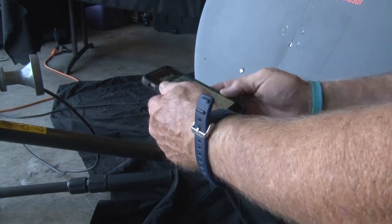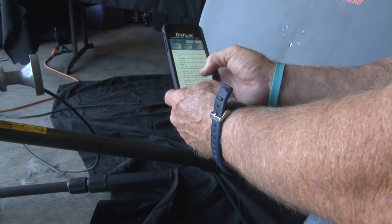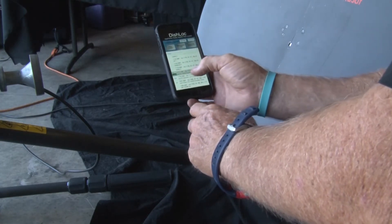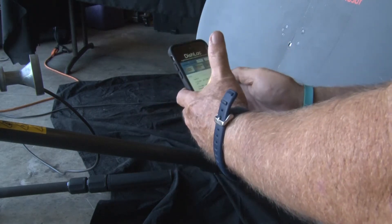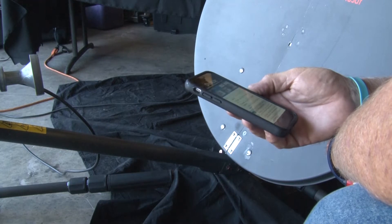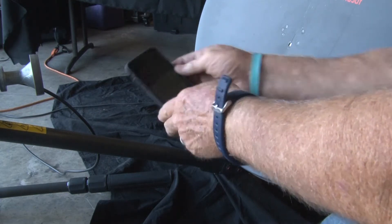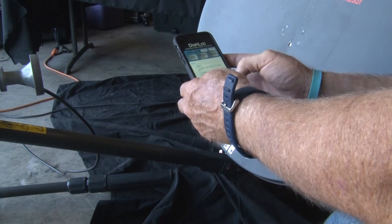Whatever you're told by the guys — say we're working on a certain satellite — you go to that satellite. In some cases you use the 111.1 W. You can see your azimuth is 173 degrees and your elevation is 47 degrees. This is from your location — it's GPSed right here where we are. So you look at that and go from there. What's cool about this one — it tells you you want this elevation to be 47, and when you rotate this thing you want to hit 173 degrees azimuth. You can do that with a compass too.